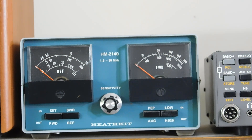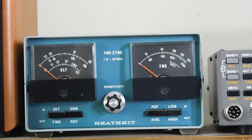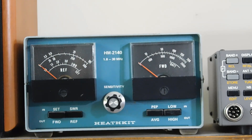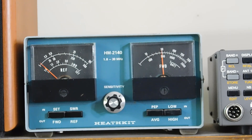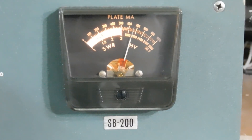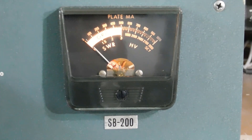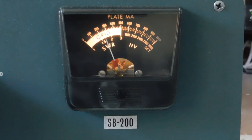All the bands kind of look that way. I can go to 40 here real quick and tune it up. Take the radio to one of my favorite 40 meter frequencies. And there's about 600 watts again. Let's take a look at the grid current there — oops, wrong amplifier. There we go. We'll go over to the grid position on 40, and we're well within the safe range.